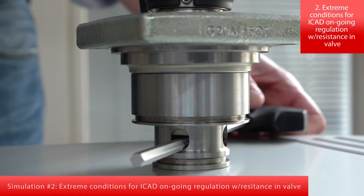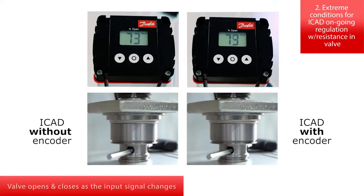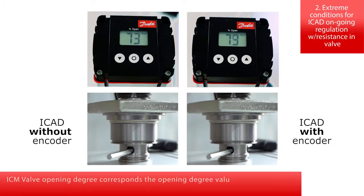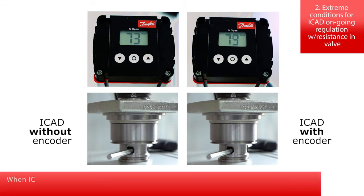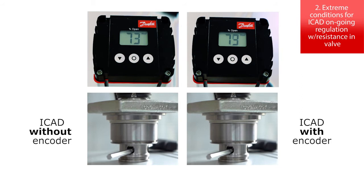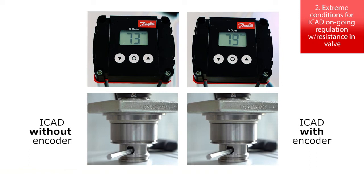Simulation number 2, ICAD ongoing regulation with resistance in valve. The valve opens and closes as the input signal changes. The ICM valve opening degree corresponds to the opening degree value on the ICAD display as long as it does not meet resistance that the ICAD cannot overcome. When ICAD without encoder meets resistance, it will not be able to register the fact that the valve seat is not moving, and the ICM valve and ICAD will be out of sync. When ICAD with encoder meets resistance, it will detect the resistance and keep track of the ICM valve position.